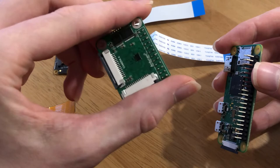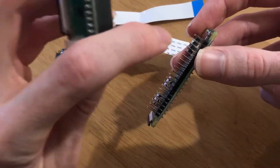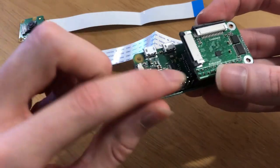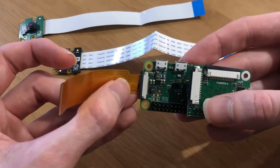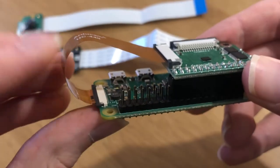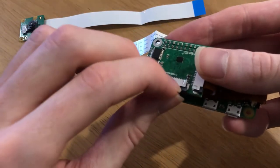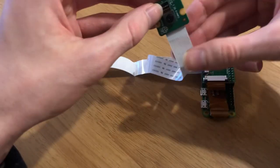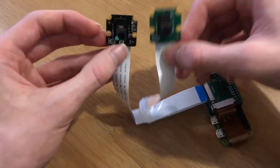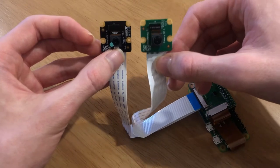I'm going to take the camera connector and attach it to the Raspberry Pi. This hooks up over the GPIO connectors, which are these pointy things here, like so. Next thing we need to do is attach this connector to that connector on the Raspberry Pi. So for camera A, which is this top one, I'm going to be using my colour camera. We've got two cameras connected but they are kind of backwards, which is not going to work great for the design I've got in mind — they need to look like this. So that's probably going to mean I'm going to have to fold one of these ribbon cables so it fits nicely.